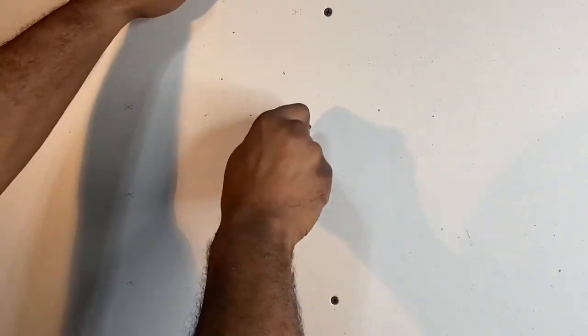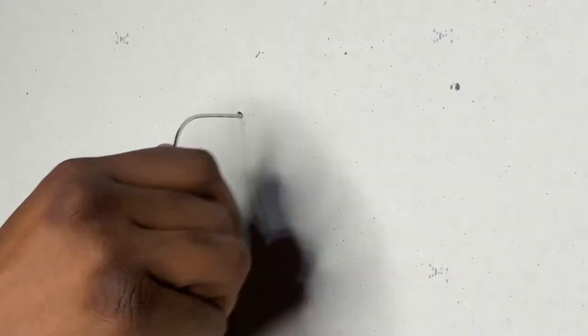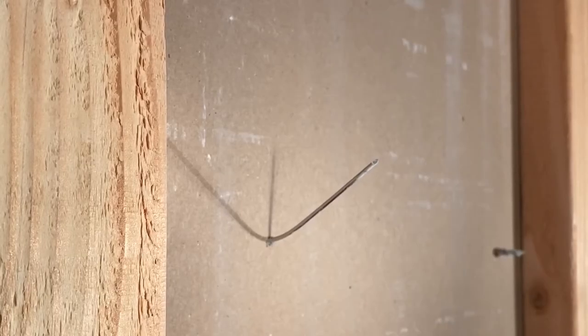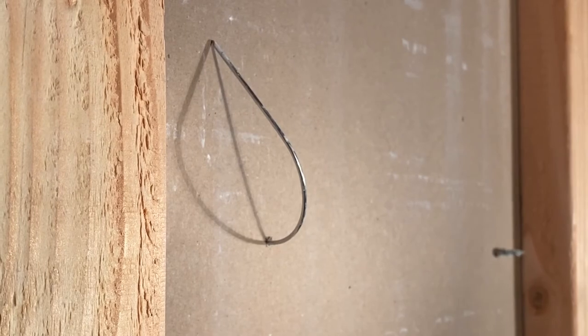Take the guide and place it right where you want to hang the item on the wall. Then place the guide back in the kit and reinsert the hook into the same hole, rotating it clockwise once it's fully in. This gives the top of the hook contact with the back of the drywall, ultimately adding more support to hold up your frame.